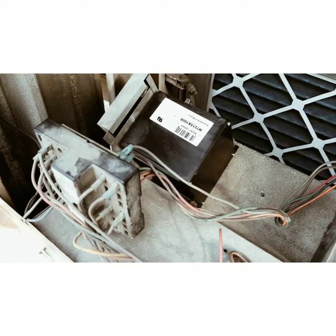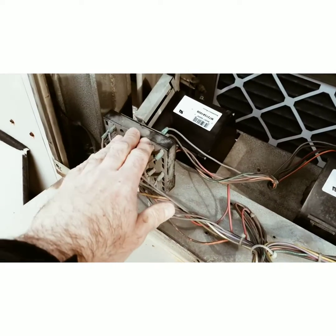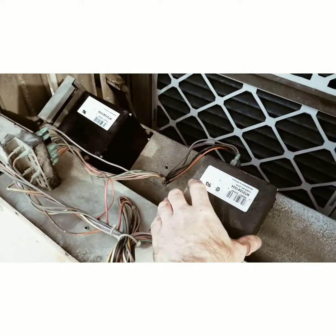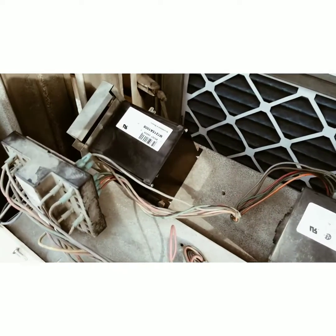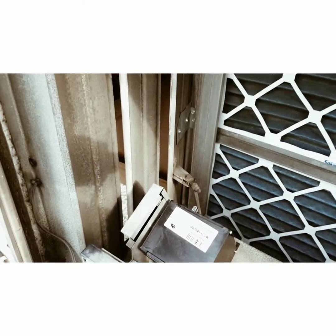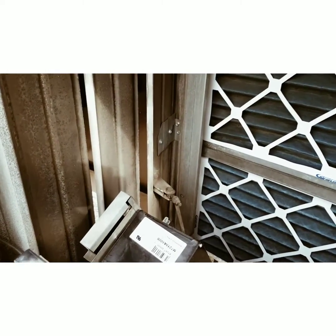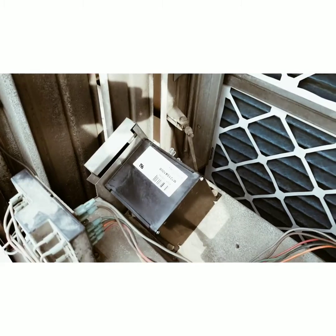Also included in the kit is an actuator that works with the Jade system. We're gonna remove this board and take the old actuator out, and we're just gonna be left with the one actuator in here. One thing I like to do when we work on economizers is give all of these dampers a good grease. They've been greased in the past — you can see that white lithium grease in there — so I'm just gonna spray some WD-40 on it to loosen it up and get them freed.